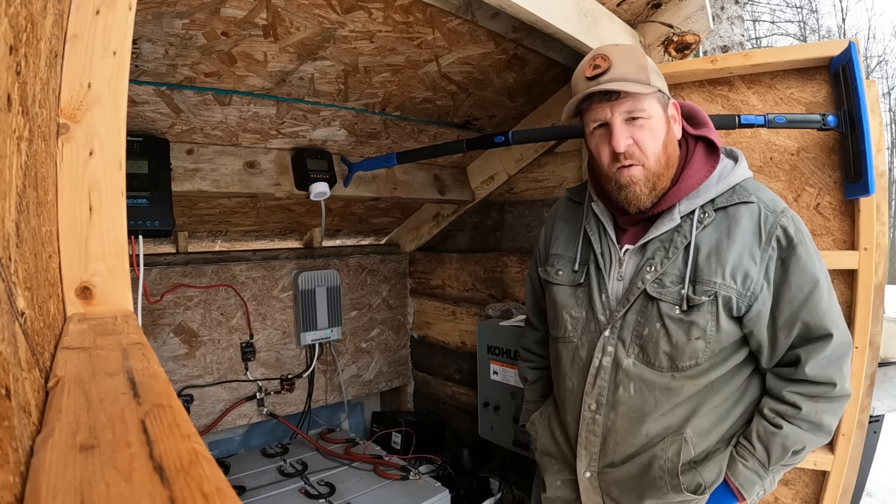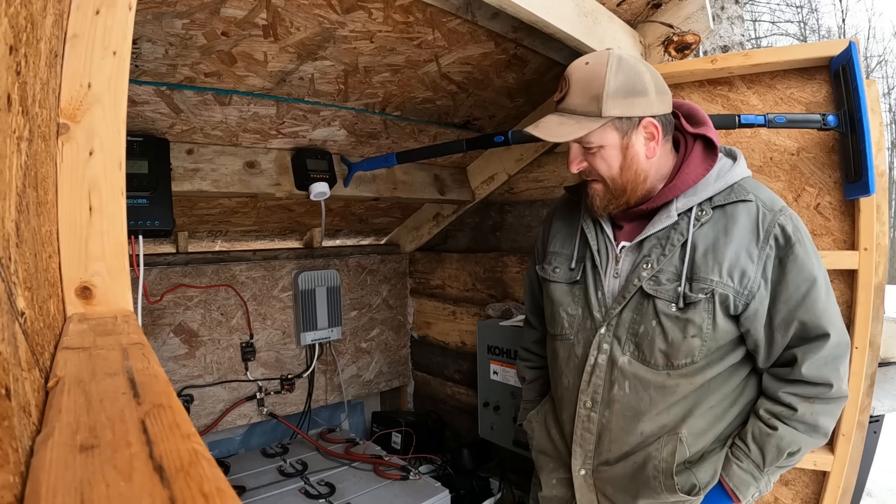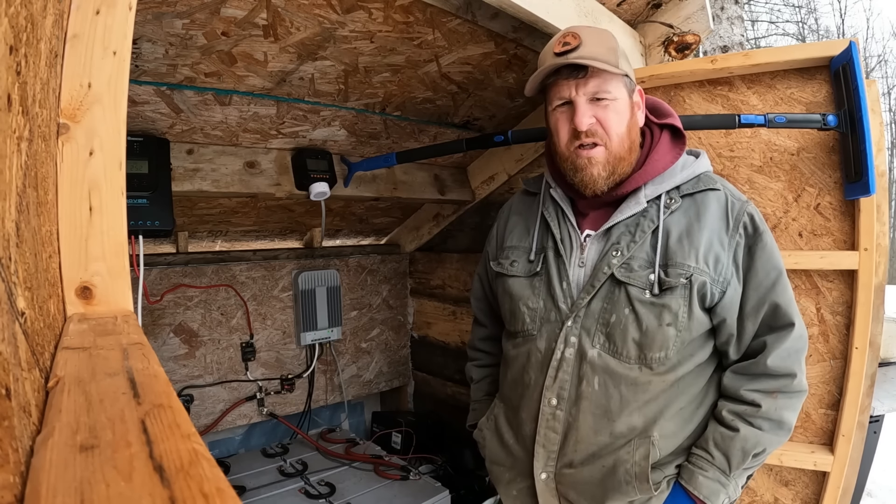Getting a better charger is on the list. This is just a cheap charger a friend gave me that only pushes 250 watts — only 10 amps — into this large battery bank. That's not efficient for charging a large battery bank. It would take days to fill it up; you'd only get 2,500 watt-hours in a 10-hour day, so it would take about 24 hours to fill this up, and that's if you're not using it.